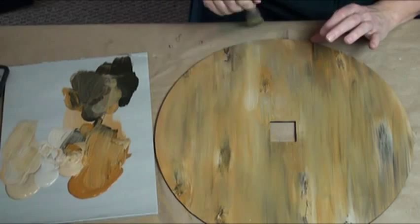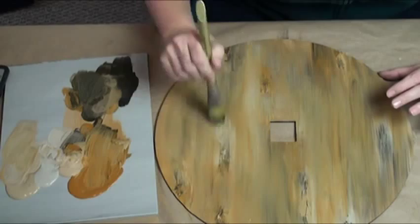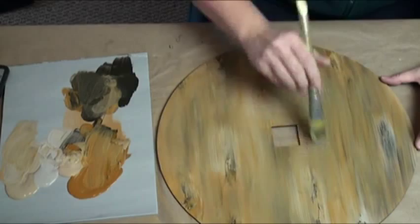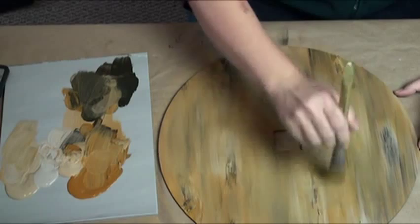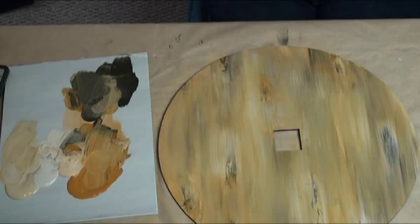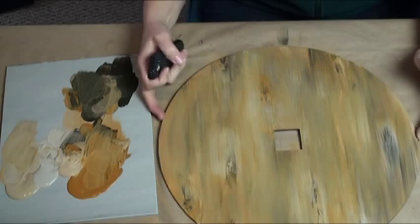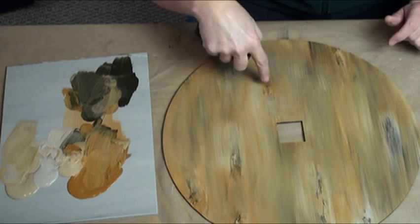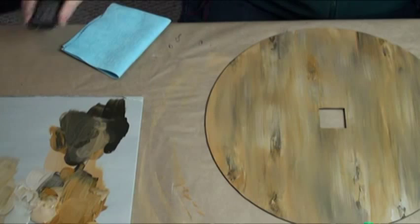I think we'll orange that up a little bit over here. We've got our grain running straight basically. These might end up being a little bit too big, these little streaky poos. Let me make sure I don't end up with them all being dark all the way down and around - I'll go back in and adjust. I always feel like I'm working for Walt Disney World when I do stuff like this. You could do this on tin - you could do this on any surface. Now you can hit the blow dryer, but if you hit the blow dryer you're going to melt your wax. Paint has to be dry before you melt your wax, so you need to dry it on cool.